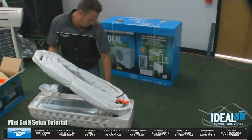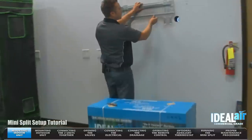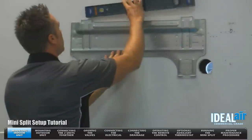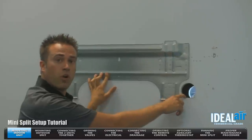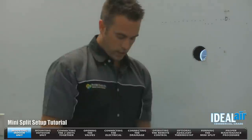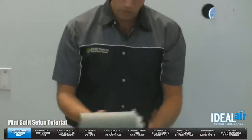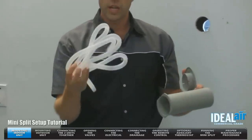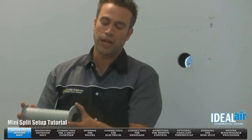I'm just going to grab a hold of it. You're going to place the wall bracket like so. It's very important that you make sure the unit is level when installed. You're going to drill a three and one quarter inch hole through your wall to the outside. The unit comes with a sleeve that's going to go inside the wall. This would be your drain kit — this goes to the inside of the wall and this mounts to the outside.